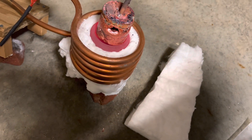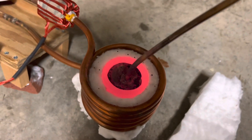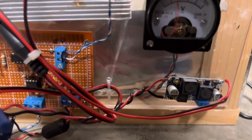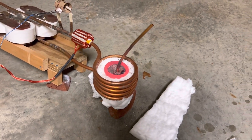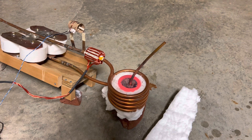We're going to put our first piece of copper in — that's going to change the resonant frequency of the coil. There it is. Now we'll plan to melt this big piece. Our current is closer to about 10 amps now after adding the copper, and our voltage is close to 170 volts. There's a bit of water in that piece of copper because I just washed it — and that's what's coming out.